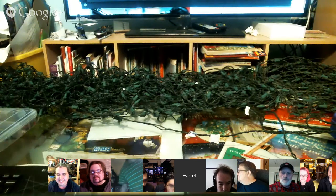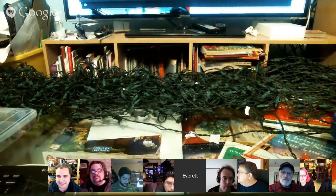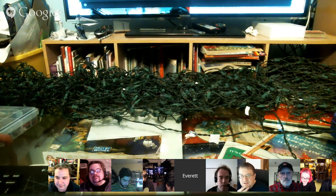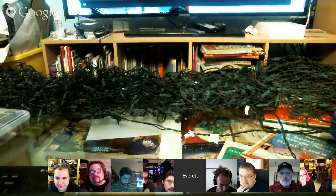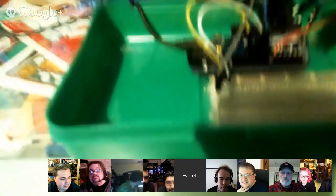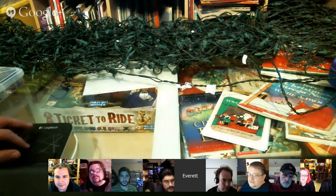For Christmas, I wish I could have gotten on before Christmas to show this, but I've got it right now. This is a light controller that I threw together with the Arduino and the FM module from the Adafruit shop. I have my control box over here, with outlets. In this box, I have all my relays. And here, I have a NeoPixel. I'm hoping to add a whole strip for next year. And my Arduino Leonardo. It live analyzes whatever audio signal is coming in and displays it on these lights. So I'm going to start a little bit of music so we can see these blinking.